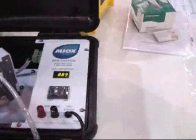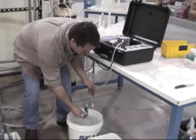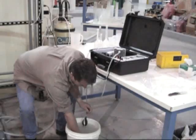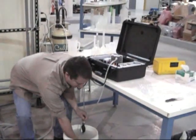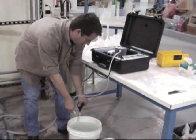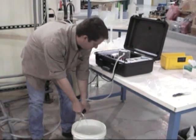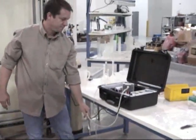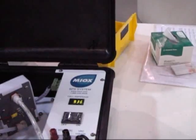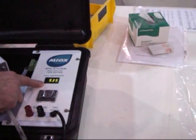As you can see, we are at almost nine amps already, so I will add a little more. I am using my arm to stir this up — you are free to use a stick or some other stirring device. Now I am going to be adding very little amounts of salt because, as you can see, we are very close to the 10-amp operating range.